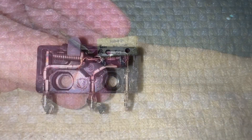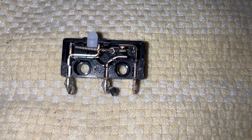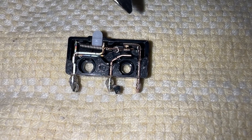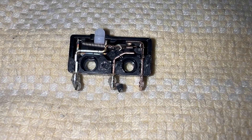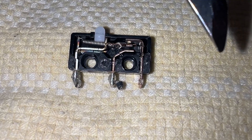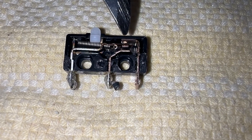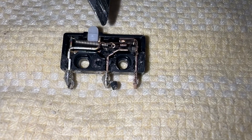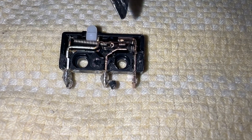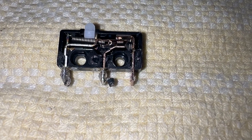Here is the inside of that switch. You can see there are three leads. Right now the external leads are the ones making contact because this metal piece is touching the top, so pins one and three — as my previous diagrams showed — would have connectivity because this metal piece is touching.